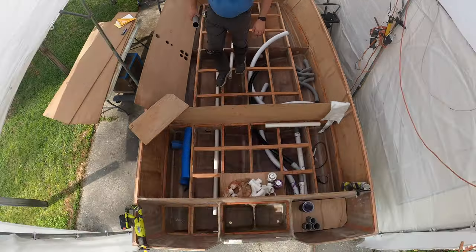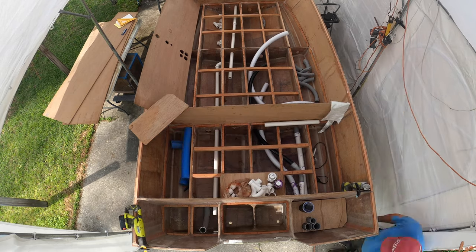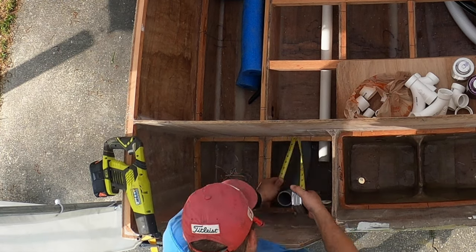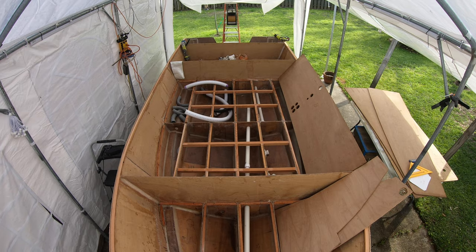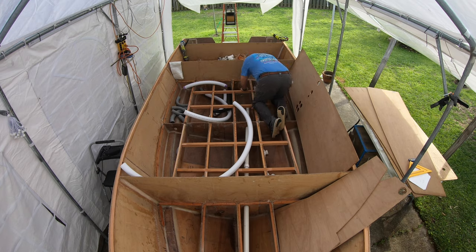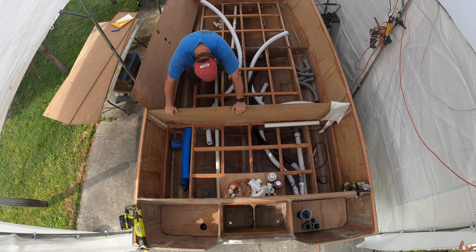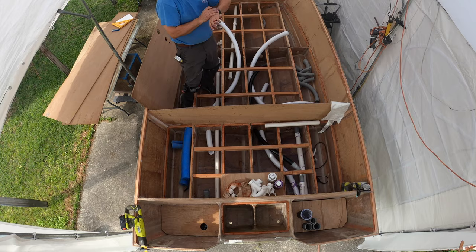Here I'm trying to see this 2-inch additional wiring chase. Before, I was trying to figure out how it was going to come up there and enter into the console from the floor. I'm trying to learn, like I talked about, I had those other wiring chase fittings too far back. So I cut this new one a little bit farther forward, so that 90 degree fitting was a little more straight up and down as it came up through the floor.